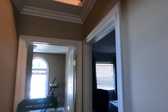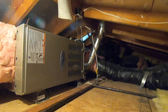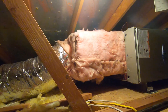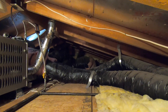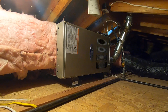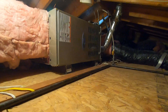All your functionality is here — heat, auto settings, and fan. This is a very good system. The main thing on this job was doing a new system and getting the heat out of this room by adding that return air. The duct work in this house was newer, done about 15 years ago — we resealed all of it to make sure there were no holes or gaps, and it's insulated properly. This new duct is a 10-inch duct, so it pulls about 300 CFM out of that room, which is pretty good. If you have any questions about this install or adding a return to pull more heat out of a hot bedroom, leave a comment below. Please like this video, subscribe to our page, and visit us at www.albertair.com.